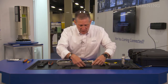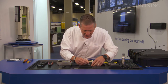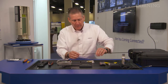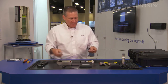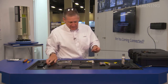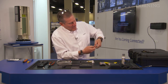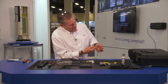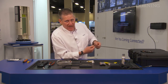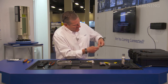Now we're going to come in and start to measure our cable for cable prepping. First, you're going to mark at 90 and 75 — these are your stripping marks for the cable. Now I'm going to take the side cutters, and this being fast access, all I've got to do is start the end of the cable, then separate the cable and start to peel it apart. The reason we marked at 75 and 90 is to give you a frame of reference of where to stop separating the jacket of the cable — you want to go past 75, but not past 90.